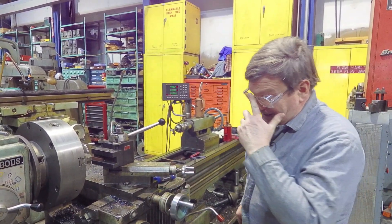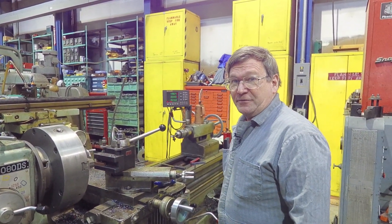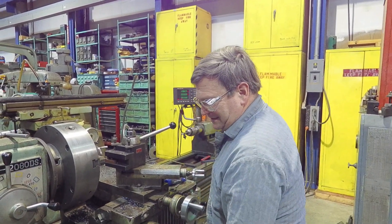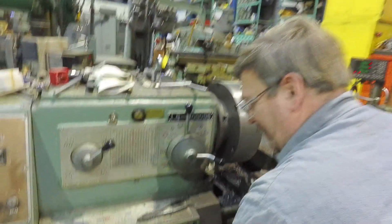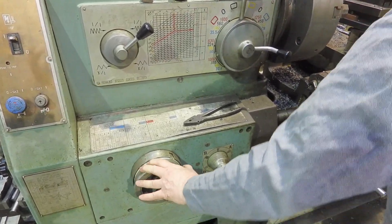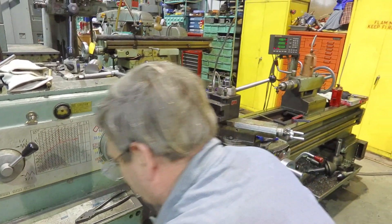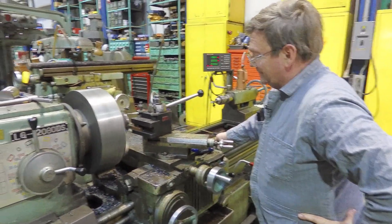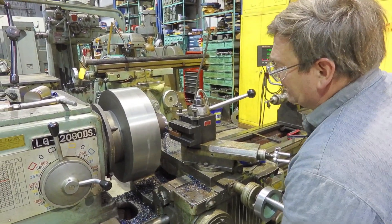You may not be able to change your RPM. Generally dropping RPM down will make them break off better, but sometimes RPM up. Feed rate — feed rate is a key one. Now I'm running about four thousandths per revolution there. I'm going to kick it up to around 10 thousandths and it may very well just start breaking off chips. But if it doesn't, we'll do something else. It's making a little more manageable curl but not yet breaking off.